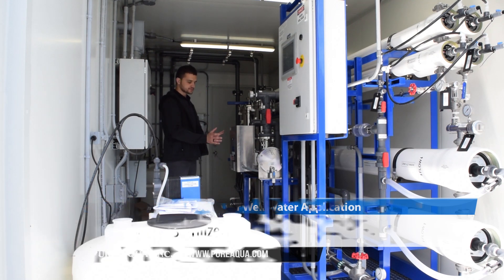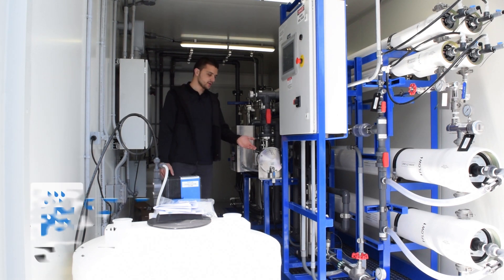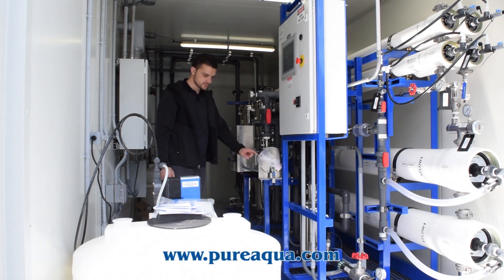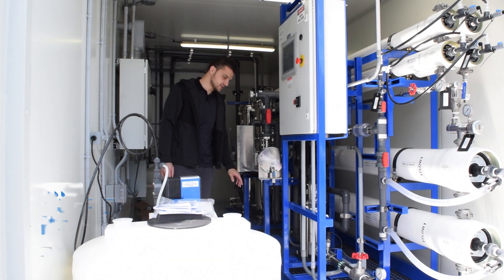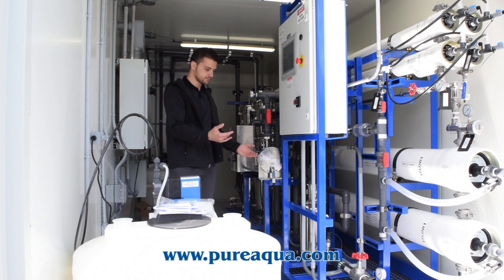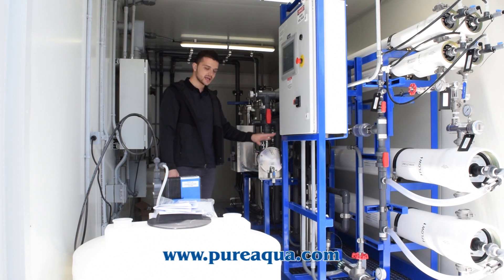That covers the low pressure pre-treatment side. On the high pressure side we have a Grundfos CRN 316 pump, which boosts the pressure to about 160 to 170 psi at 40 to 50 gallons per minute. We're utilizing electropolished stainless steel 316 with pressure gauges before and after the throttle valve to measure pump and system pressure. We also have a high pressure switch to protect the system and pump against over-pressurization.